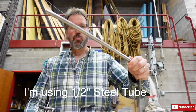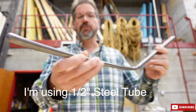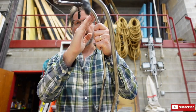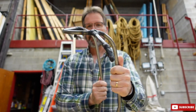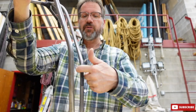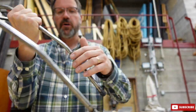I'm using half-inch round tube — it's a weldable tube, and it's really great to use because it's very easily bent. I can make the rest of these bends just on my bench vise. This bend right here on this axis was just done on my vise. I put this part in the vise and by hand torqued this thing down, putting in a bend — which is really more like a kink. You can sort of see that it is just kinked here, and that was just so that it fit the shape of my actor.